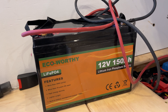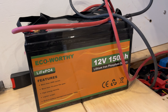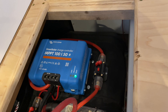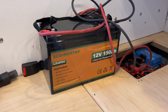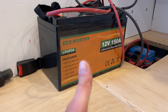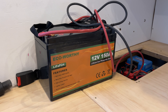You need to have something set up so it won't charge when you're at below-freezing temperatures. I currently have a Victron Smart Solar charge controller — I can get an adapter for that so we can configure it not to charge at that temperature. But overall this battery is performing pretty awesome and I'm happy with it. We're going to give it a thumbs up, and I'll get it installed with the rest of the batteries.